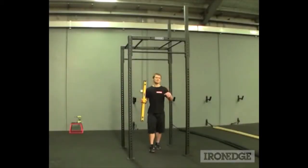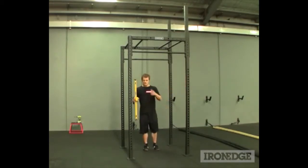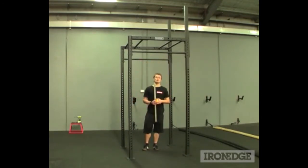Now, before you dynabolt the matrix cell to the ground, you want to make sure that all of these uprights are nice and level, and you've got the right distance at the bottom between the uprights as you do up at the top. Otherwise, the thing just won't line up and it'll be all out of skew.